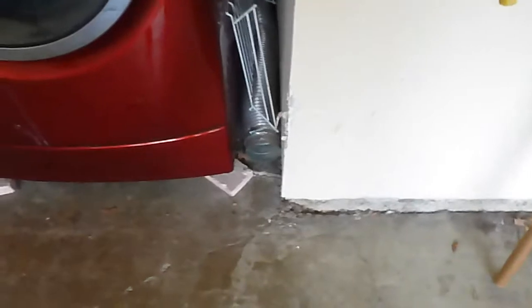The clothes dryer vents directly into the garage, which is improper. We need to have a conventional safety tray hookup. There's a laundry hookup there, and the hot and cold are not labeled differently — they're both red handles. This is not GFCI protected, and the garage is not GFCI protected.